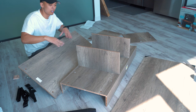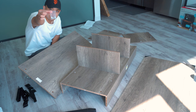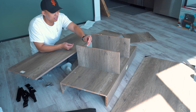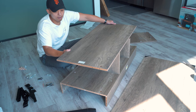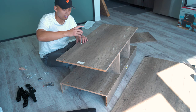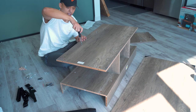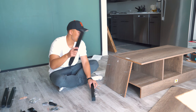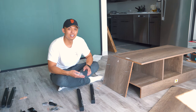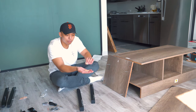Next, we're going to place the number seven wood on top of this, using four pieces of letter H and four screws of letter A. Place the letter H tool in the middle parts, then place it right on top. Make sure the four big holes are facing outside, then place the screws on top and screw them in nice and tight. Next, we're going to attach legs number eight and nine to the side panels, which are numbers three and four. To do this, we need eight of letter C and eight of letter H — the wooden ones.